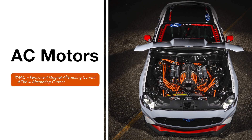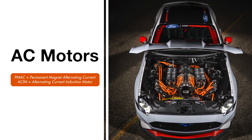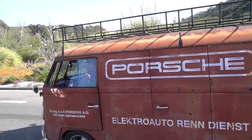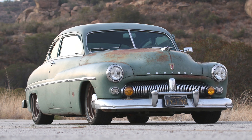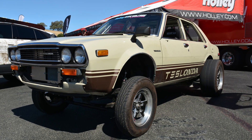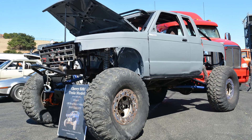Let's start with some hardware. For the most part, modern EVs use AC motors. Most of these are PMAC — Permanent Magnet AC — or ACIM, AC Induction Motor. DC is still out there, but DC motors aren't efficient enough for a street car. They have a little more instant torque than AC motors, but generally don't have the RPM capabilities that an AC motor has. A wider power band means better drivability and more top speed without a lot of gear changing.